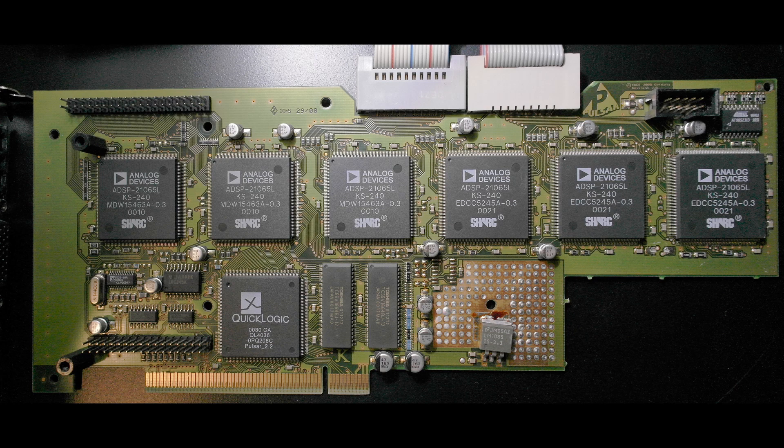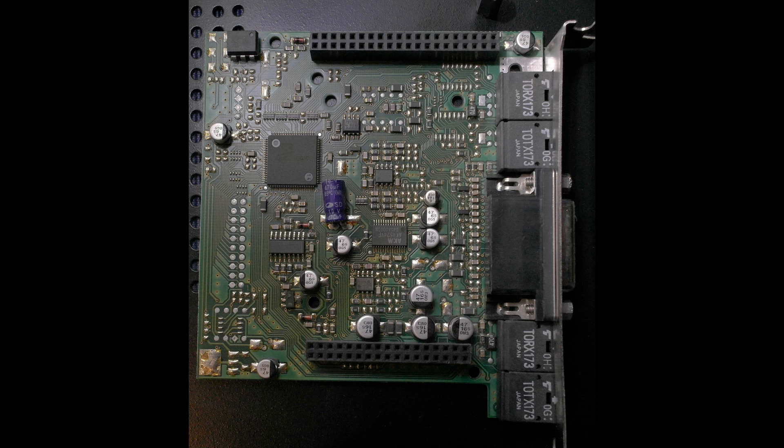Once I'd replaced all of the components on the main Pulsar 2 board, I reassembled the machine and found that had solved the crackling, distortion sounds, and the inability to sync to any S/PDIF input or output. However, I also found that MIDI input was not working. My theory is that the capacitors on the MIDI input component of the IO board aged at the same rate, and in the same way the S/PDIF stuff failed, the MIDI input failed too. I then took the IO daughter board out and replaced the capacitors on that as a separate piece of work, and in doing so I was able to restore the MIDI input functionality. The card is now 100% working again. The only difference on the daughter board is that one capacitor is a traditional through-hole type rather than surface mount, so the technique was slightly different, but apart from that fairly straightforward.